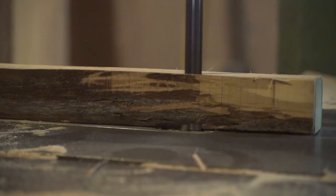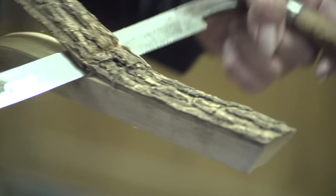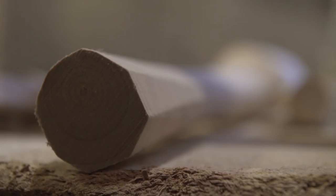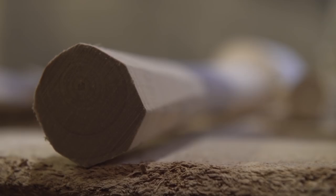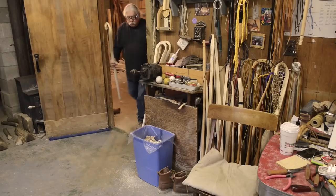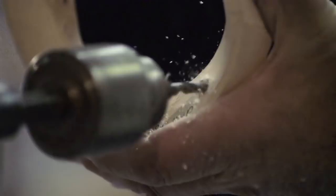Then on the carving bench with the drill and two-handed draw shave, you carve the shape of the head across the head part. Then you cut the handle shape — the octagon shape of the handle — and usually I balance it again. When that's stabilized and it won't warp anymore, then I freehand drill all the holes. I don't mark holes. I don't have a template that says where the hole's going to be. I just do them all freehand.